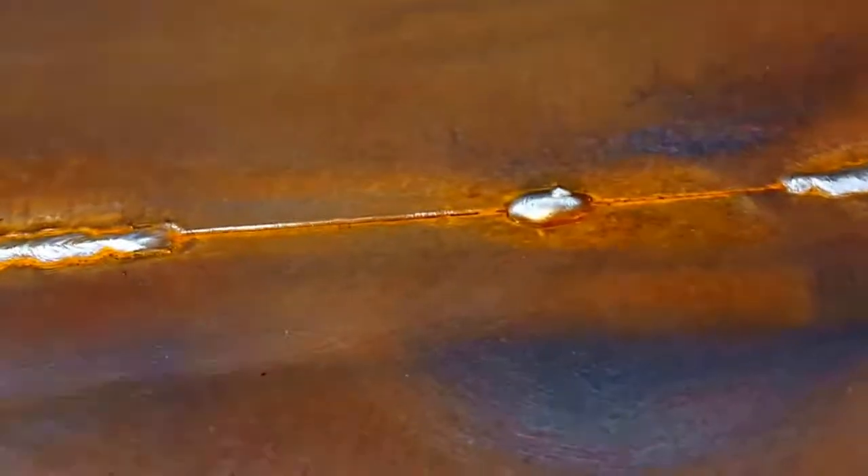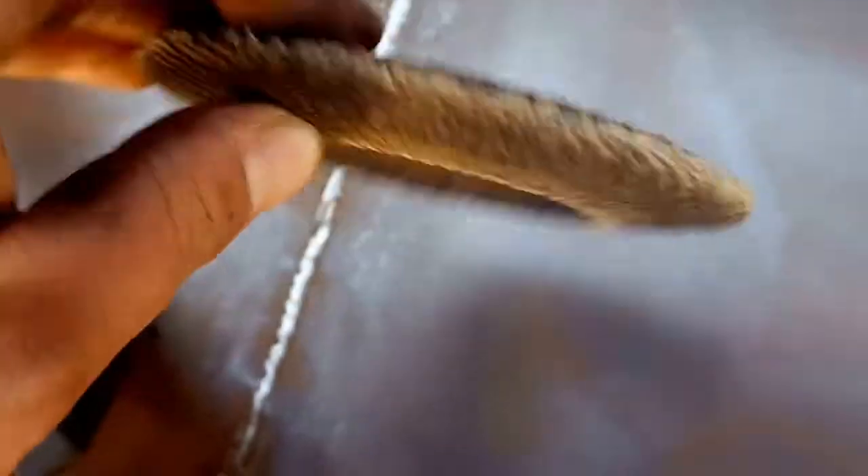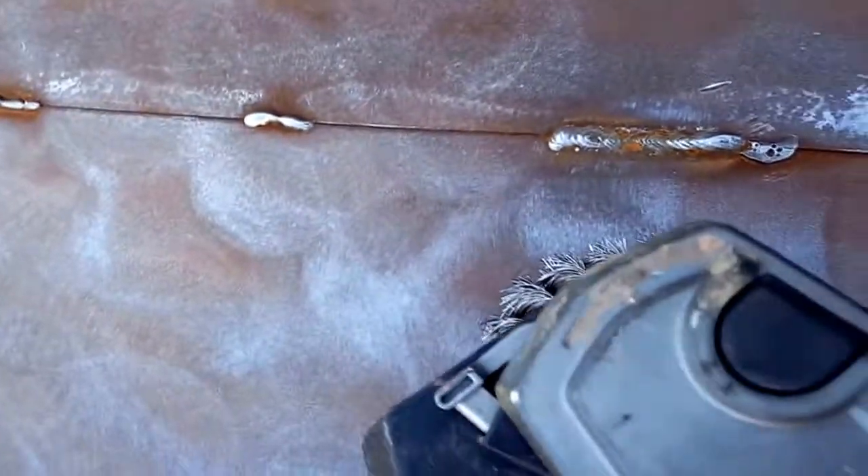Now it's not my trailer, I didn't build it — it's a customer's trailer. I'm just gonna clean some of these up. There's some dags from where he welded it. I think he welded that bit with a stick welder. I'm just gonna knock some of them off. I don't want the customer having dramas with dragging furniture on and off the trailer. So we use flap discs so we're not stupidly aggressive into the steel.